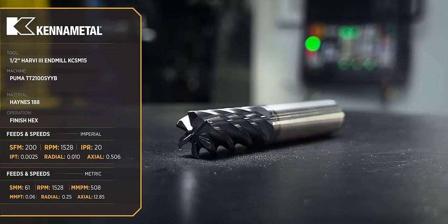Now going in here, and so we go good. We'll hit our bottom. Again, there are always two parts to gauging your threads. You got your go and your no-go. Obviously, you vets know that. All right, thread looks good.